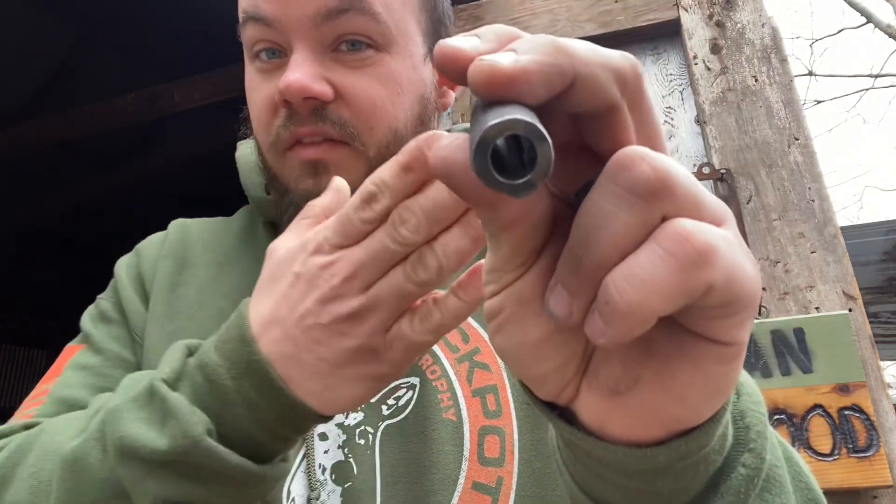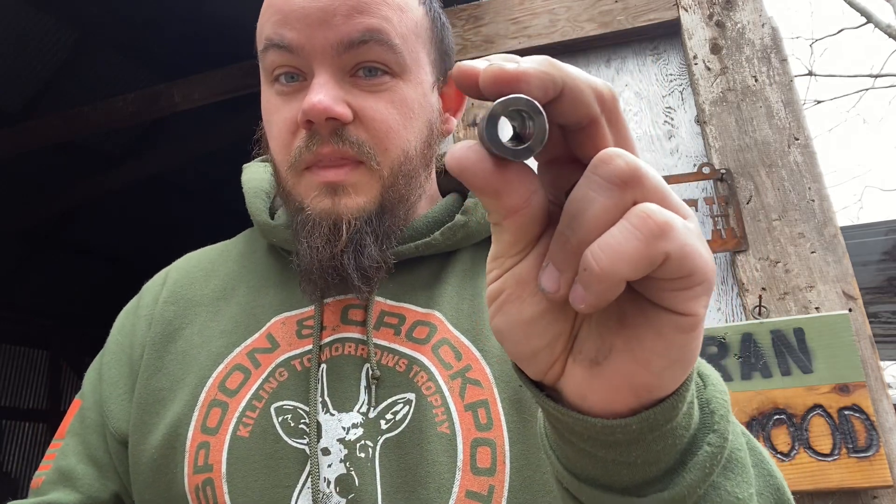This is obviously a weak spot, so somebody with more talent in gun-making thought: what if instead of forging it in, we cut it in instead? And then they went on to develop the rifling bench. I think the spiral wrap method is the predominant way barrels might have been forged, which gives it that lazy twist. Looking at the twist in this and my 1863 Springfield, it's about a 1-in-72 — about the same pitch.